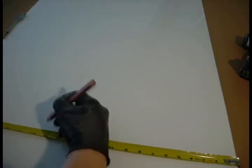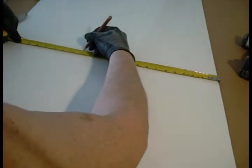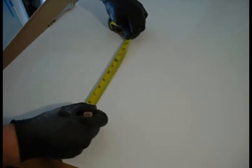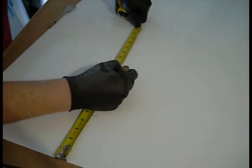All right, so we're gonna lay out this tub surround. We got 15 inches from the right side over. So let's make two marks, 15 and 15. And then our tub spout was at 4¾. Are you seeing this? Our knob was at 9 7/8.